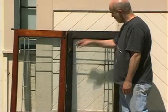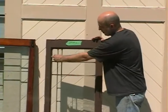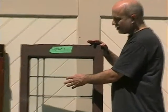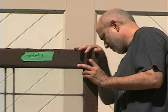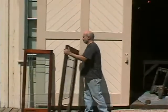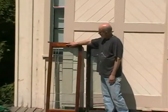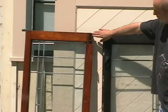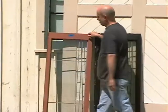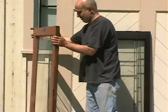This one's finished — needs one more coat of shellac and the glass is all done. On the other one, first I have to remove all the putty, take out the sash, then take the sash apart, clean all the glass, then rebuild the whole window, take all the paint off the sash, strip the inside, get some shellac on the interior — which is just what the original shellac finish looked like — then reinstall the glass, putty the panel into the sash, and some priming and paint. So there's a lot of steps to doing these.